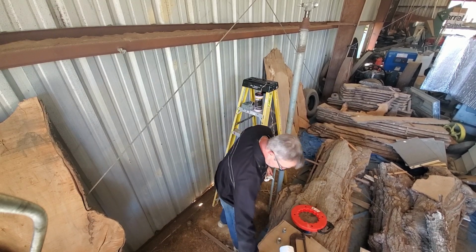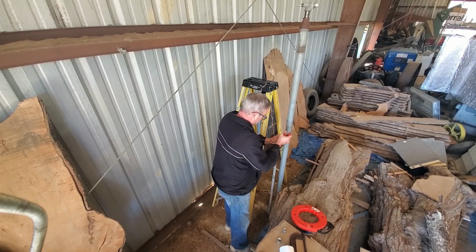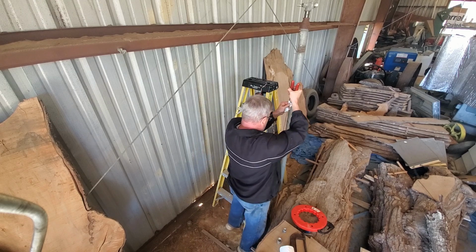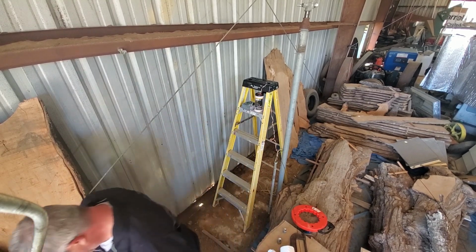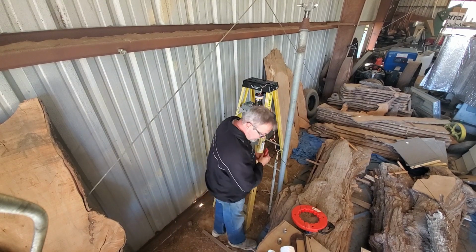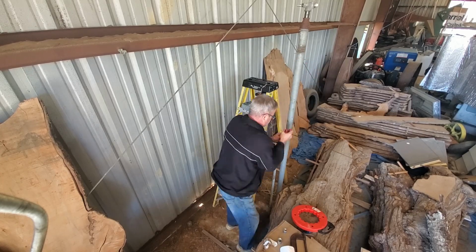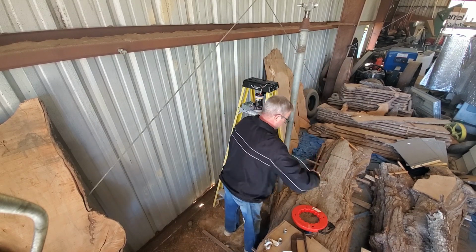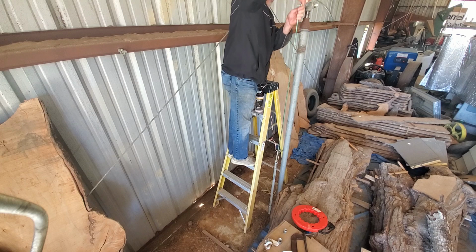So far so good. I'm just trying to wipe the slime off of the fish tape as it comes out. Maybe halfway with it. Haven't yet had to resort to putting a C-clamp on the fish tape. Check my spools. I think one of my spools might have hung up on something. Broken edge of the spool came around and hung things up. So, success. Now I've got to pull out enough to reach to where I want the service.